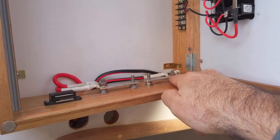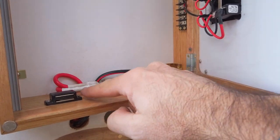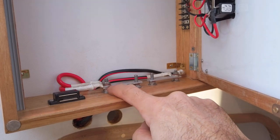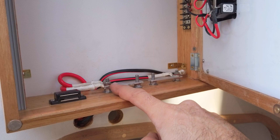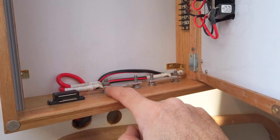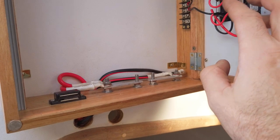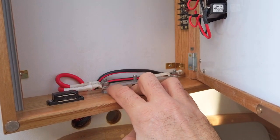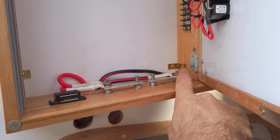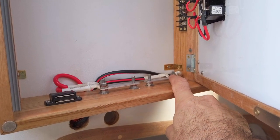This is the positive bus and this is the negative - both sides of what you would see in a battery, negative here and positive here, with a decent separation. What's coming in is power from our solar regulator and power from one of the battery banks that's selected. The solar regulator is putting out regulated DC power from the solar panels - at the moment about two and a half amps. It can charge the battery, but because it's regulated power, it can also run whatever is running off here. This cuts down cable runs and the need for relays. The wind input will go through its own switch and then be connected to the batteries to charge.